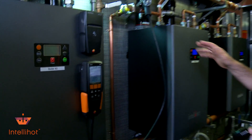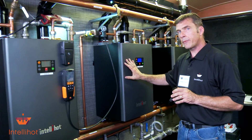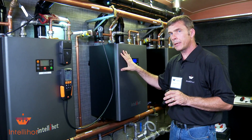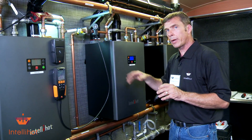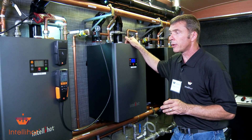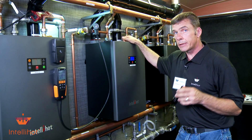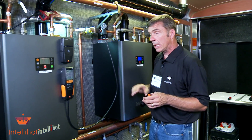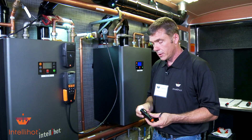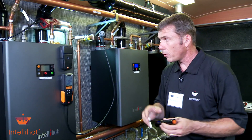Always make sure when you're doing your combustion that these are set from the factory. You have a propane/natural gas dip switch in here — just make sure you have your dip switch set right for natural gas or propane before you start the process, or if you've converted it over to propane. Pretty simple. All the steps are in the I.O. manual, and any time you need any help, you can always call the techs at the factory and they'll help you — very nice folks, willing to help in any way they can.